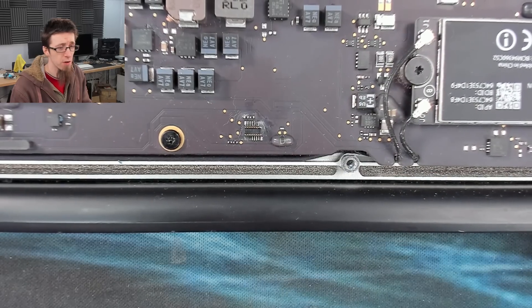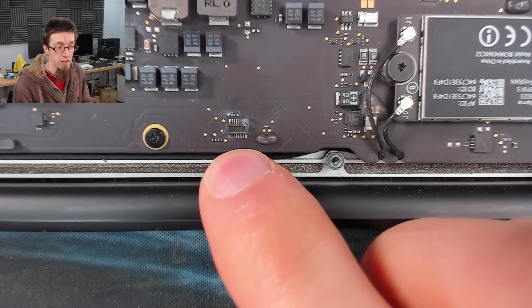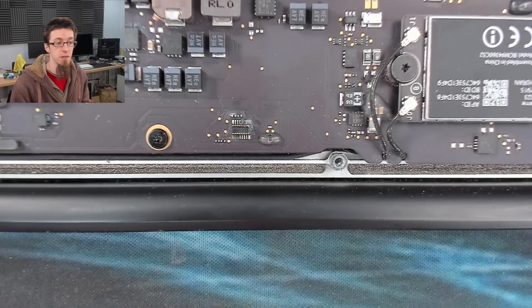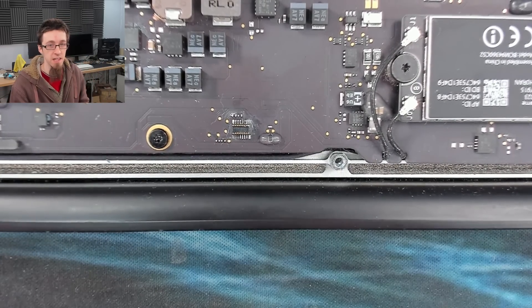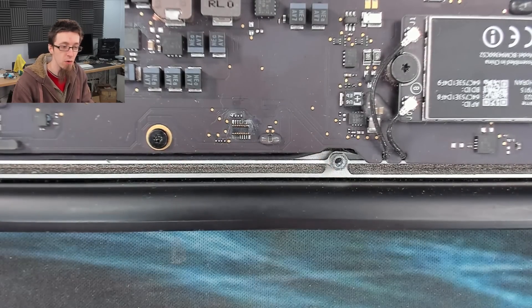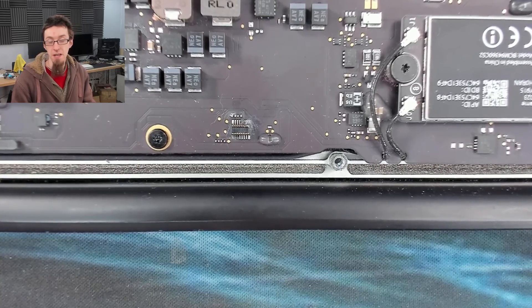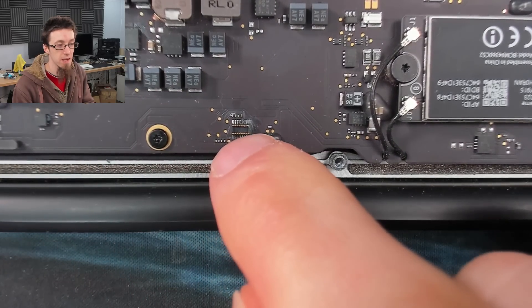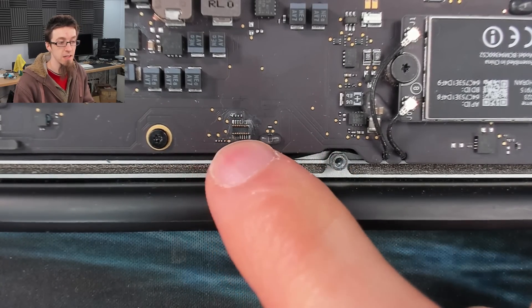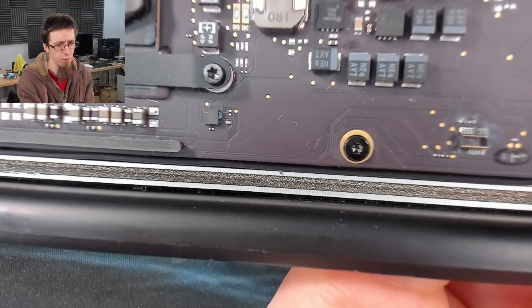This is an absolute classic for causing problems. Louis Rossmann infamously went through a phase of just removing these on-site on anything he worked on, even if there was nothing wrong with it, because this diagnostic port has all of the really important signals going to it. Basically all of the mission-critical things the laptop needs to work all go to one nice little port that's right on the edge of the board, right at the back of the laptop, right where liquid damage is going to hit first. It's a really stupid place to put it. That is entirely likely to be our issue — it might just be a matter of cleaning this up or ripping it off the board.